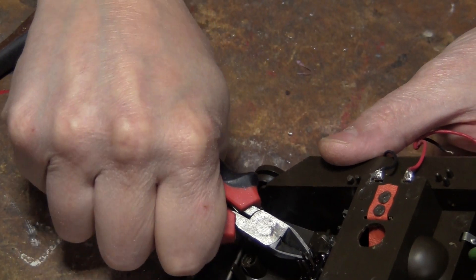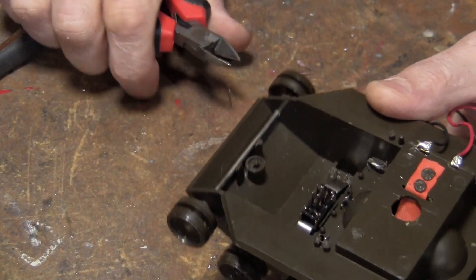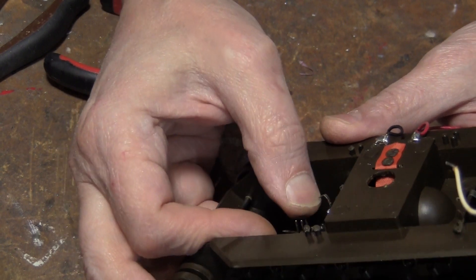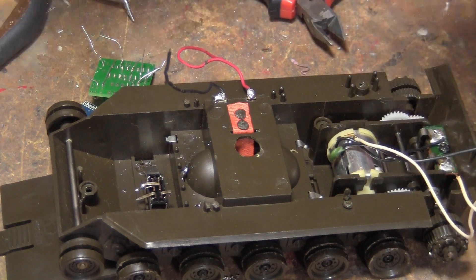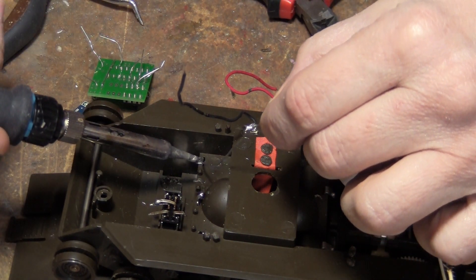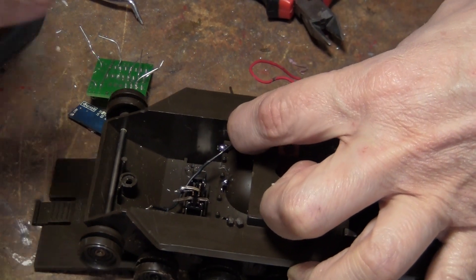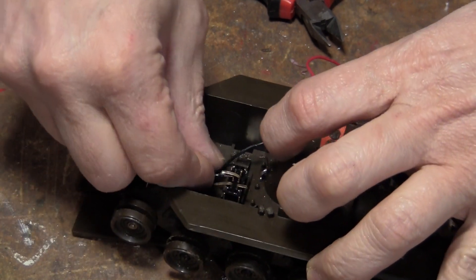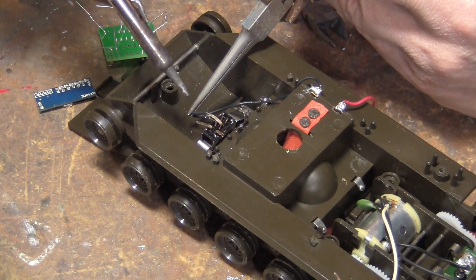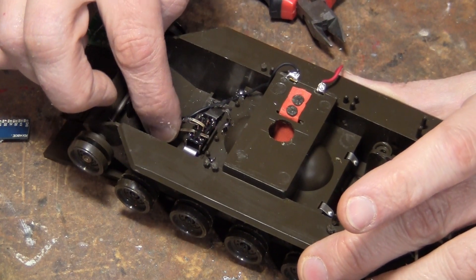I don't even need these — that can go away. Boom, those two can go together. I think a good thing to do is just to connect the grounds. That's the ground from the 9-volt, and this is the ground from the double A's. So those two can go together, and then this can come down here on this side of the switch. So the negative — one side is going to go to the electronics, one side is going to go to the motor.